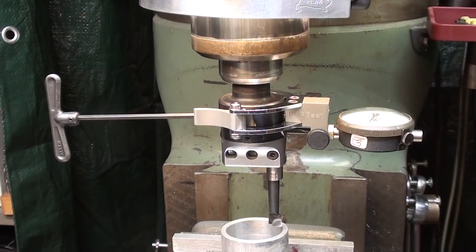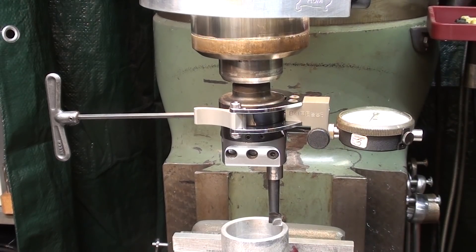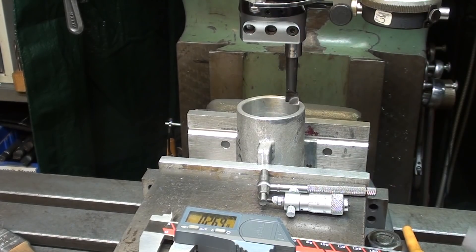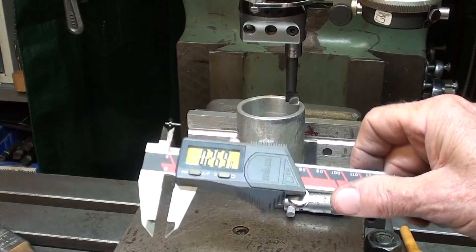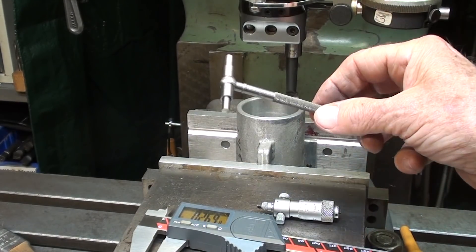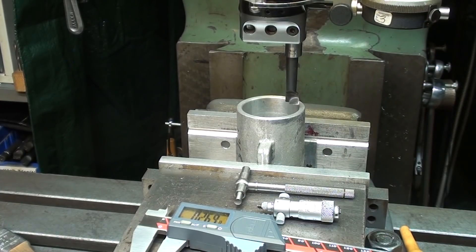The Bore Set is now mounted on the Bridgeport mill. I have the Criterion boring bar in the spindle and the indicator in place. I cannot emphasize enough the danger here if you would turn the machine on while this is still attached. It is meant to be on there only momentarily while you make your adjustment and measuring, then take it off — or it will fly across the room, destroy itself, and might destroy you. So take warning when you use this. At some point as you are machining your project and getting close to the dimension, perhaps you've already checked it with the scale, then with your digital calipers, dial calipers, or an inside micrometer — I often like to use a telescoping gauge. Now you are within two or three thousandths and just a little bit afraid of running over and ruining the work piece.